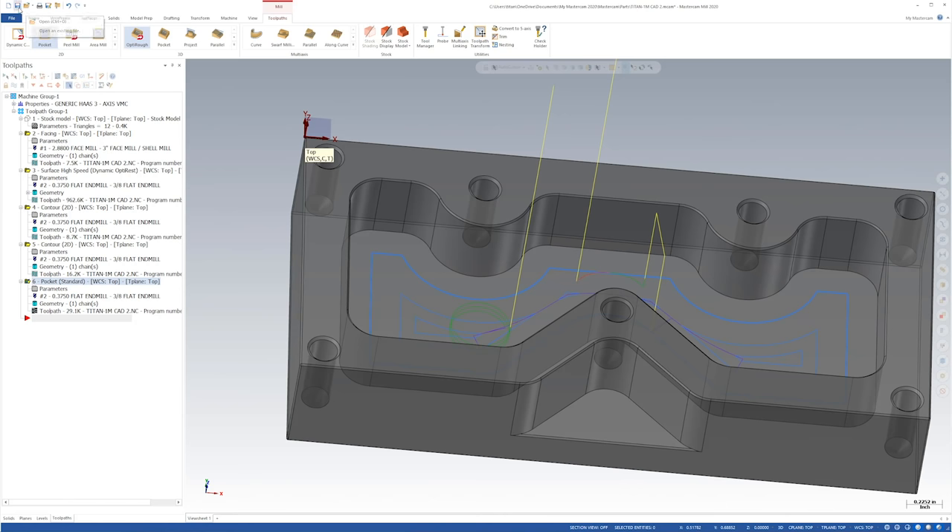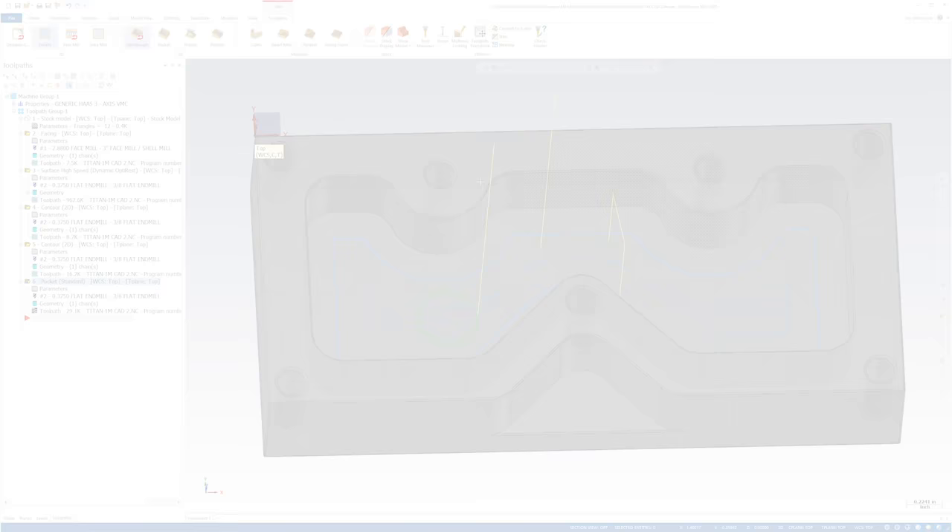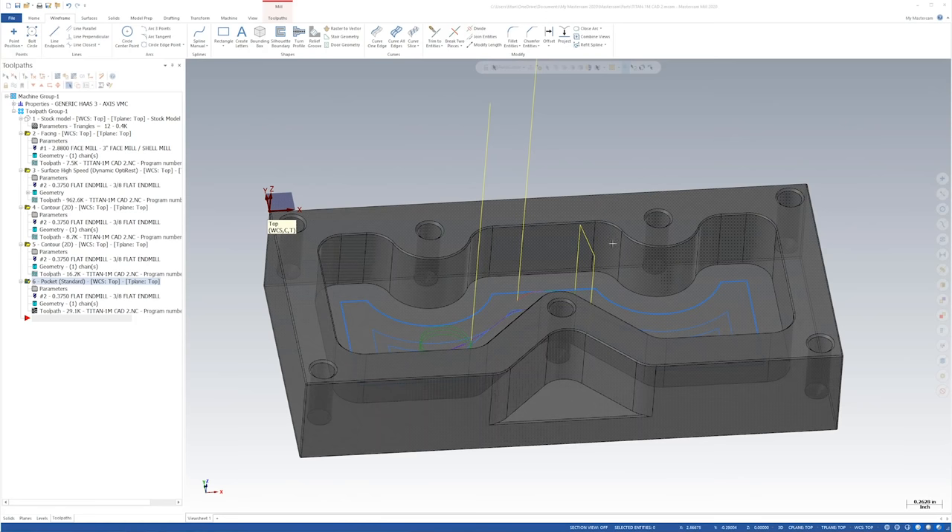Check this out — if I hadn't put that negative 0.4 on the feed, we would be feeding from up here all the way down. But instead it drops into space, drops down, gives a nice path right to the bottom, and then starts cleaning up. Over here same thing — it goes up, goes over, drops down, then radials into the cut. Nice and perfect. That's it for the hard stuff — everything else is going to be easy. The next thing we're going to do is create the chamfers going around the part.